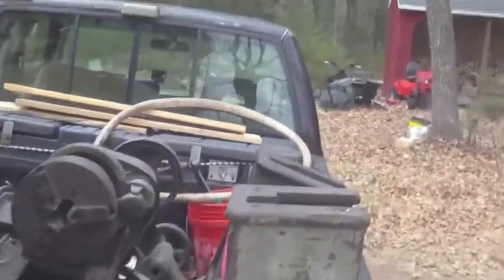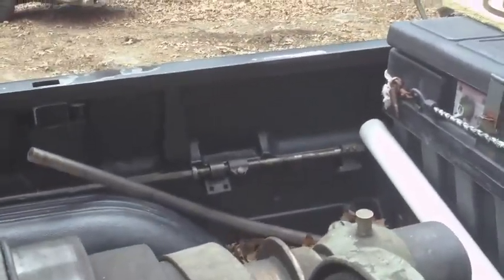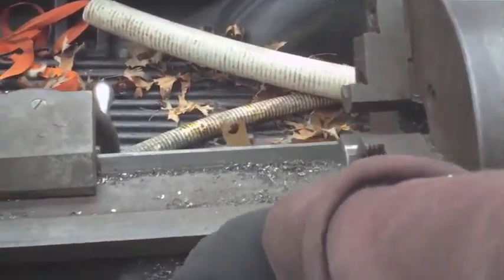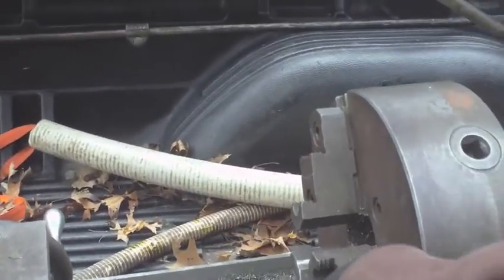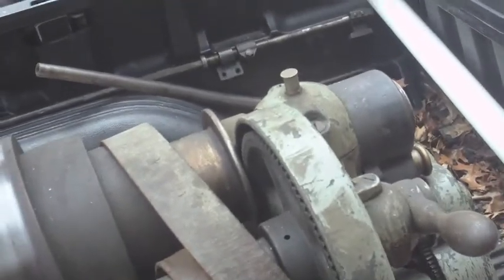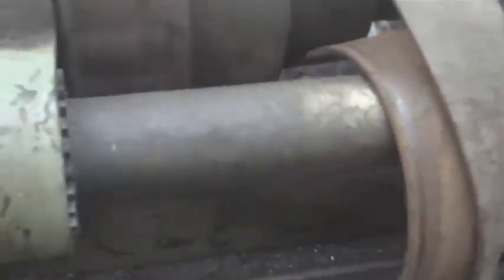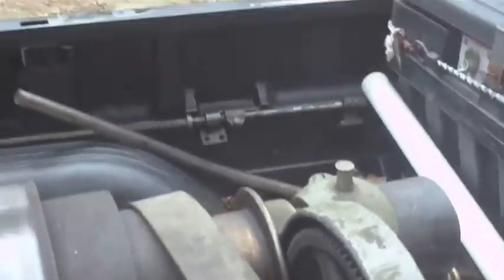So now I gotta hook up, and I know it's a sin, but I'm actually going to hook around that spindle as part of my lifting. I got it lined up so I should be able to get this center support area right in here, this webbing, really sturdy. I'm going to hook onto that, but because most of the weight's concentrated down this end, I'm going to need another lift point over here. I'm not going to be able to get a strap underneath the bed, so I'm going to try and get something under the spindle here.